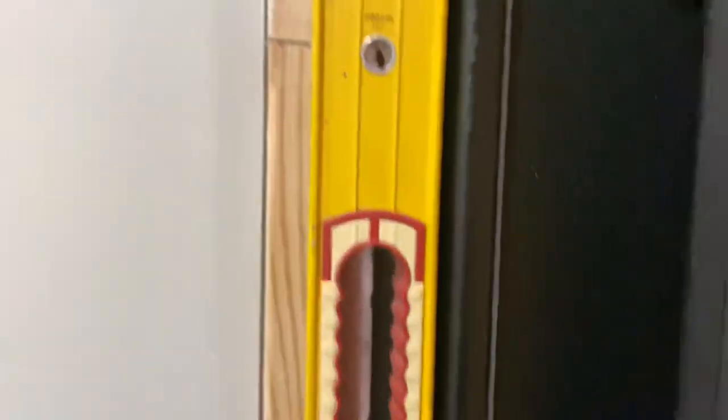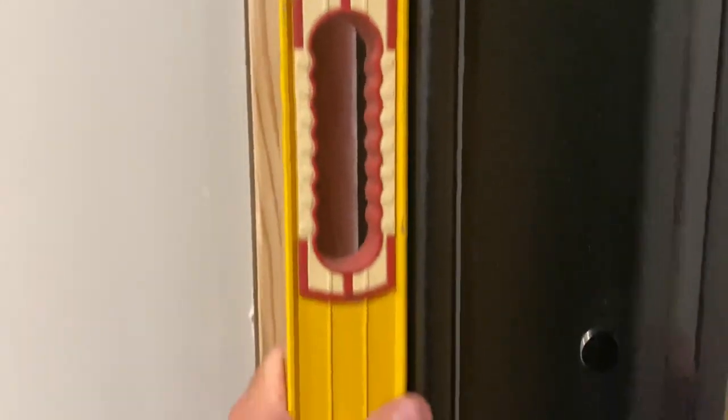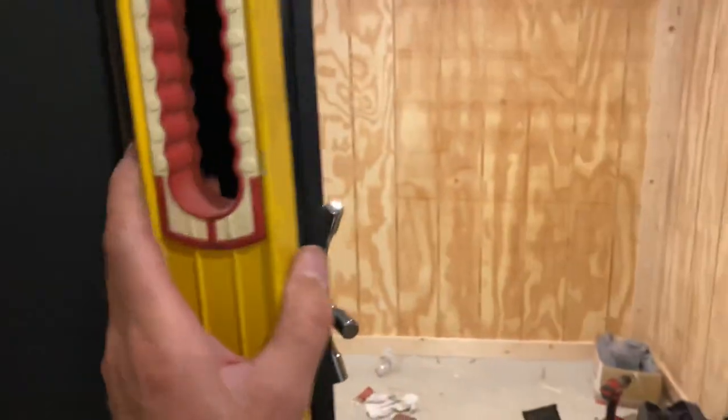And you want to be plumbing, especially the hinge side, but you want to make sure that you're dead on there. So plumb it from both directions, right? And make sure everything's good before you tighten all those up. All right. Okay, so that's that.